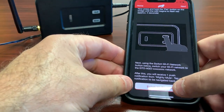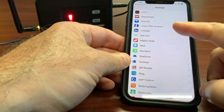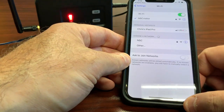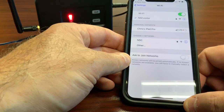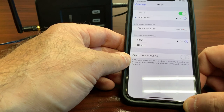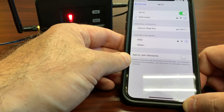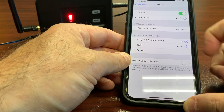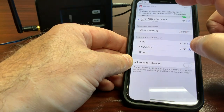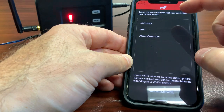Let it go, then switch Wi-Fi network. Go back to Settings, scroll up to your Wi-Fi settings, and you should see an AGO access point — Automatic Gate Operator access point — show up. It might take a second. There it is — click on that.